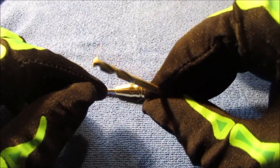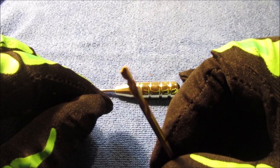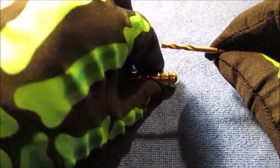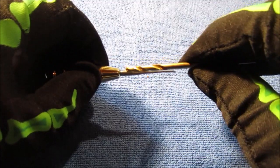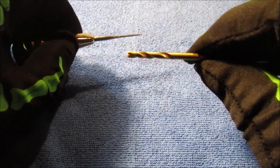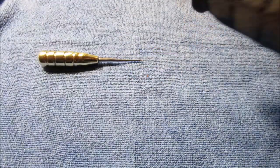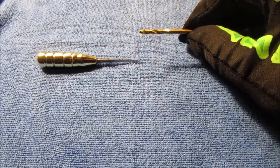These are the Hercules with the split point, 135 degree, whatever. I didn't even use the center drill on the lathe. I just brought it up carefully. And I already had the taper head this time. I just brought it up carefully, pecked at it, and it found its center. So I did not have to use your typical lathe starter bit. You know what I mean? If you're into that machining, I could show a picture of one, but it's just a special little bit.